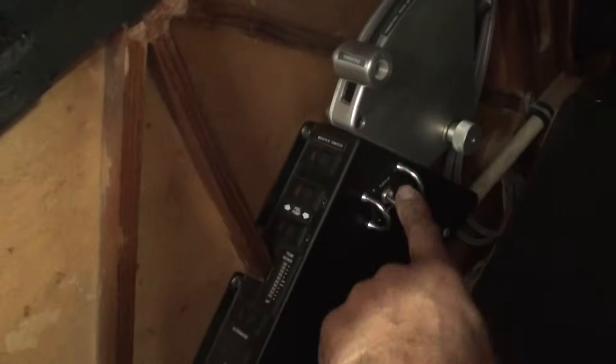One thing I do know — every time I come back from a taxi test, I hold the throttle like this and somehow I keep hitting the flaps and putting the flaps down. These guards are too wide, too far apart, and I can't close them in. But there is another guard that goes around the switch that I'm going to order — it'll be harder for my knuckles to hit. I really don't have any other place to put the switch, so I'm just going to buy a different guard.